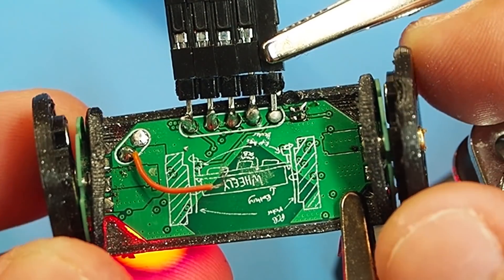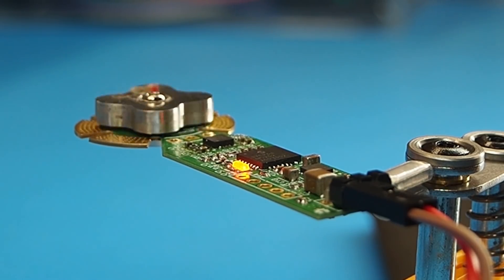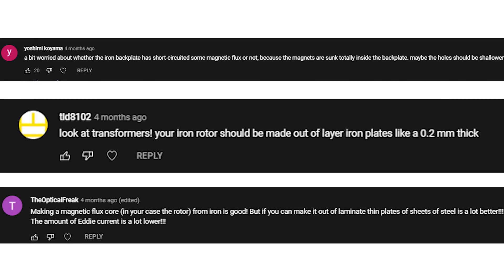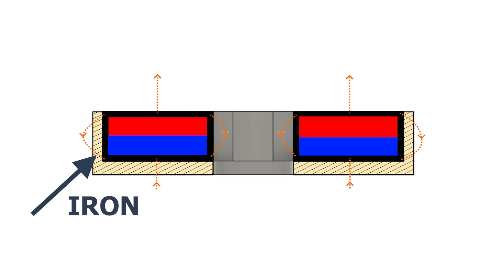The rotor wheels need to be less wobbly, more reliable, and possibly more efficient, so PLA wheels are not going to work. In my PCB motor video, I made an iron rotor where the permeability of iron enhanced the magnetic field of the magnets, which increased the torque. There were comments suggesting to have an iron back plate instead of making the whole rotor out of iron, as the side iron might be shorting the magnetic part, so I'm going to test if this is true. I designed two different rotors.